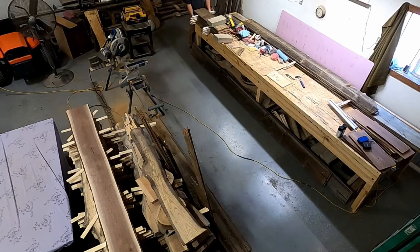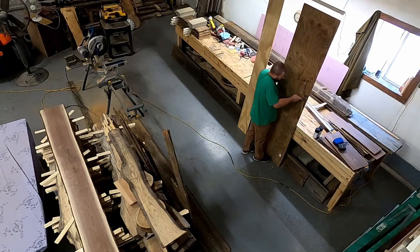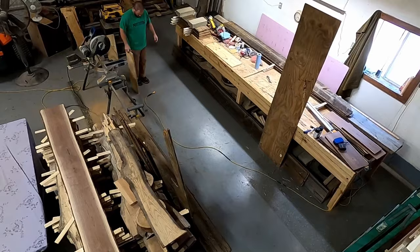I've got some three-quarter inch plywood here — this is going to be the backer on the underside of the tabletops, giving it a nice solid base for the legs to attach to. I debated a lot about how much overhang to leave. The barnwood was a little flimsy, but I think I made the right decision leaving about two inches all the way around. With the plywood underneath, it really made things pretty solid.